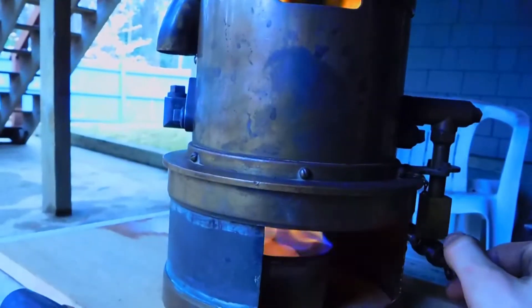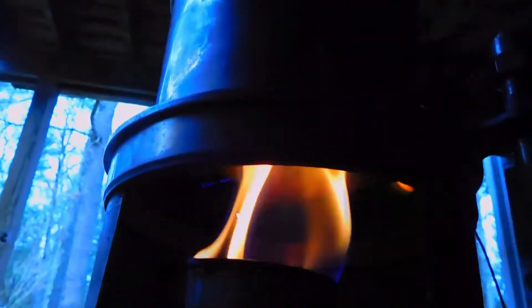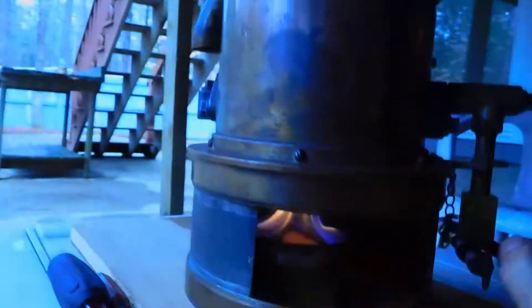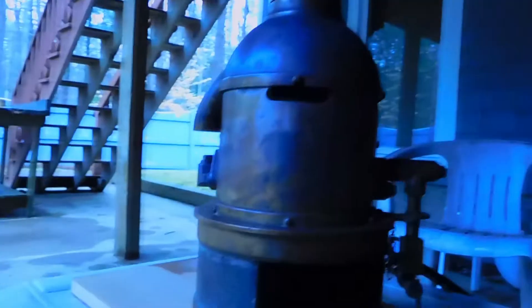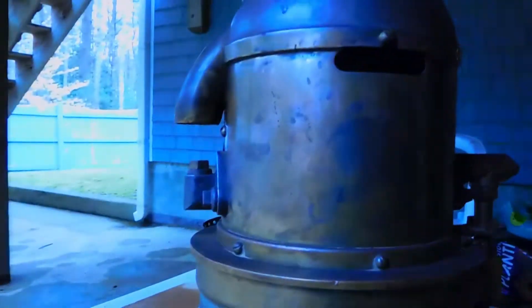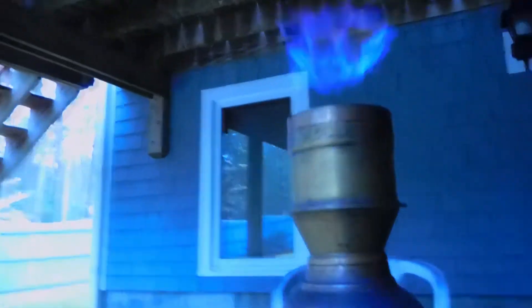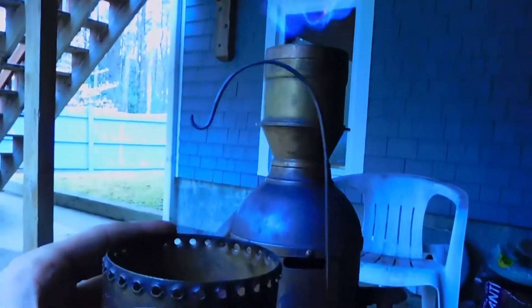There's also a second fire, which should have started on the Bunsen burner underneath — you can see those two blue lines. I'm going to put the camera down and remove the pre-burner and get this thing working under normal operation. The burner is now running normally. While it's warming up it will surge up and down from time to time — do your best to control it. This is the Bunsen fire — those two little blue lines of flame inside. This would normally have a mantle on it. This is the head that fits around and holds the mantle suspended from this hook. If the mantle was on there right now, that hook would actually be glowing red hot.